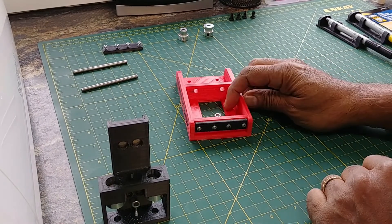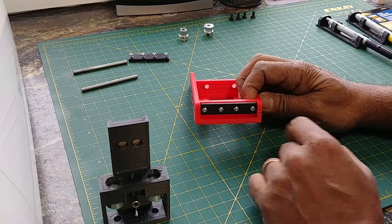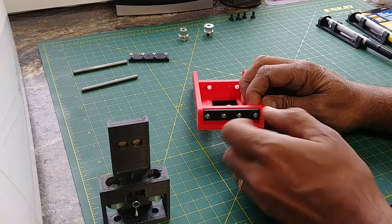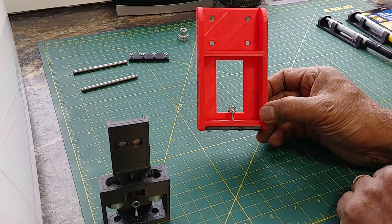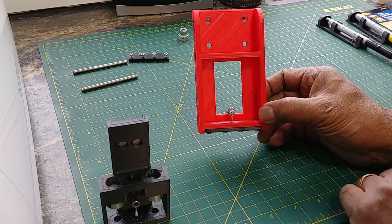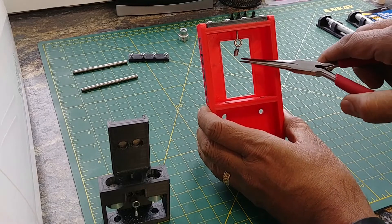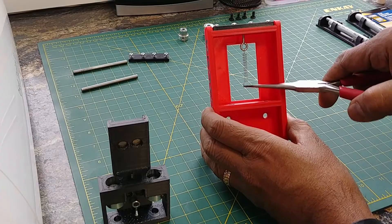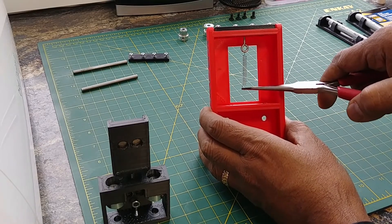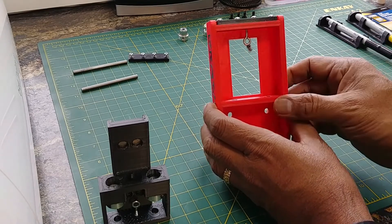Let's talk about the frame. One of the caps is mounted at the bottom with four screws to cover the holes. I wanted to have the ability to take it off if needed. These are just picture eyelets — I just screwed them in. It doesn't really matter how long they are, as long as they go in deep enough. And then you're going to want to pick out a spring. You can attach it now or later. The strength should not be too strong, so you might have to play around with some springs. I just had one in my junk drawer and looped it around this eyelet.